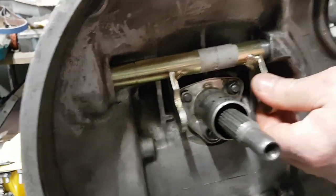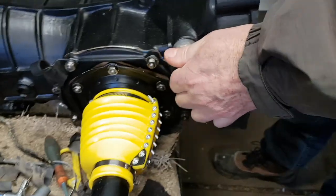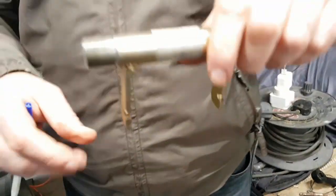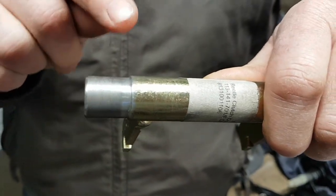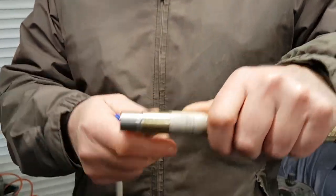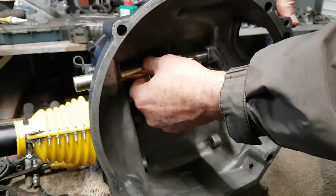See that? I've fitted that one, hand fitted it to the bearing that was in here. I'll pull it out — just there. And as you can see, this surface here — I've used sandpaper and I've brought that down slowly. I brought it four thousandths of an inch down, which is 0.1mm, and I've done that slowly. I've flattened it off; it wasn't totally flat. And now it fits in size for size, it's an H7 fit.